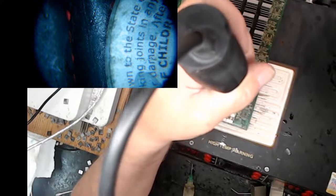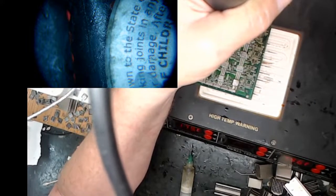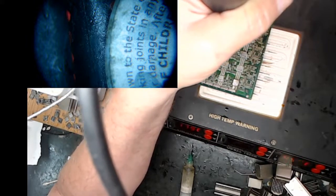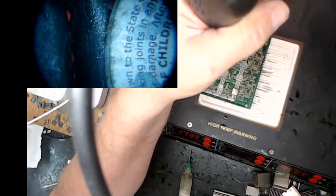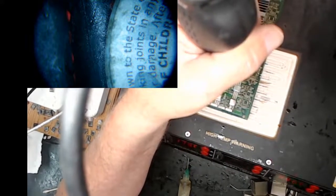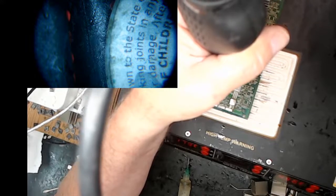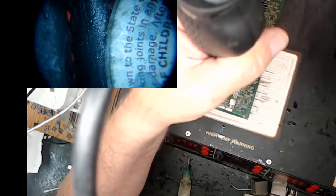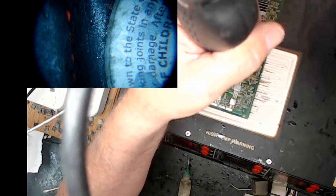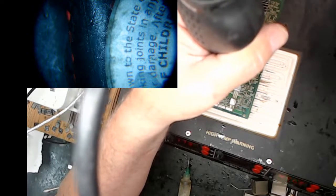I'm gonna move the light just a little bit because I used the reflection on those pins a little bit. Okay. Hopefully I didn't move you off. I moved you a little bit off vision, but hang on just a sec. I'm just heating it up. I move it back just a touch. Still working it. Now if I would have put too much flux on those pins, it would have seeped down to the pad and then maybe start to boil, and it would actually shove the chip up and off where I've placed it. So I don't like doing that. I don't use that much flux.